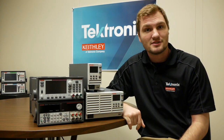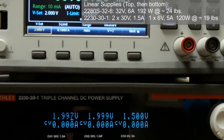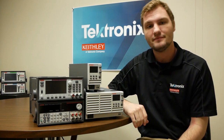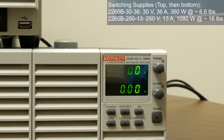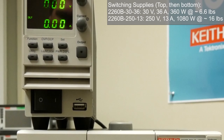There's also linear versus switching power supplies. Linear power supplies are typically larger, a lot heavier, and deliver less power with less efficiency, but they tend to be high accuracy and have very little noise. You'll notice two linear supplies here on my right. Switching power supplies tend to be lighter, more compact, and deliver lots of power, but they tend to have a lot of high frequency noise and are generally less accurate. You'll see two examples here.